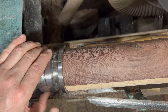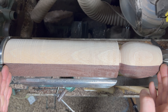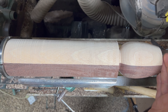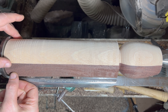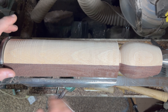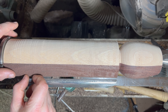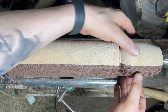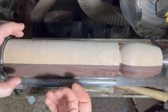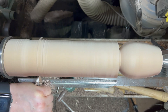This is originally 14 inches long and it's going to end up slightly smaller than that. The foot — I don't want to mess with the size, it needs to be the same as the top there for stability. The stem is going to be very long with as many captive rings as I can get in there. I don't want rings the same size as the top and foot, so I'm going to take it down to a desired outer diameter — only taking it down by about half an inch.